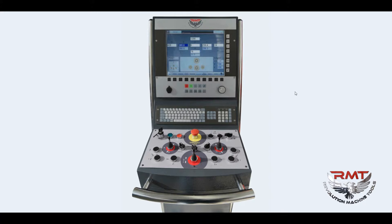We control both ends of the rolls for parallel and conic operations. We call them X1 and X2, which is the left roll; Y1 and Y2, which is the right roll; P1 and P2, which is the lower roll; and Z, which is the rotation of the rolls.